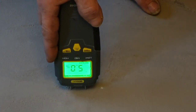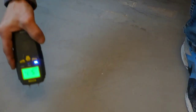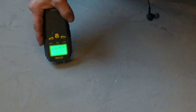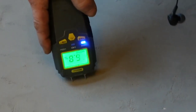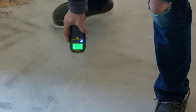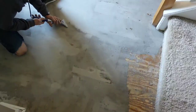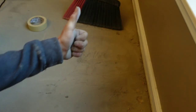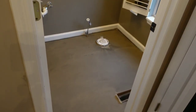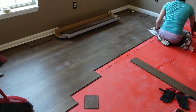It's been a long six days and we are ready to throw this floor in, but we cannot forget the fundamentals of floor installation. If our floor has a moisture content higher than 12%, we can't install. Lucky for us we are good to go. Just a few scrapes in a couple small areas and we're ready to roll this underlayment out. With the floor super smooth and flat, it was time to get rolling on this floor.